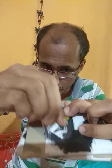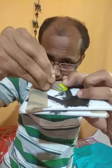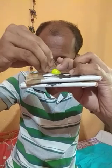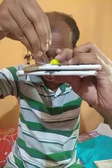Now one question is here, that these portions will be locked. How do we lock it? We will lock this portion by caulking tools. This is a tool like this, and we'll hit this portion, and by this type of tool we will just paste these points with the structure and lock it with the main structure. And this is done by caulking tool, and this procedure is called caulking. Okay, this procedure is called caulking.